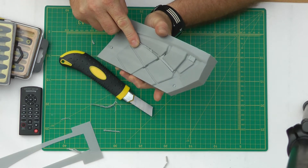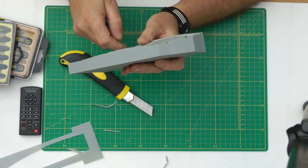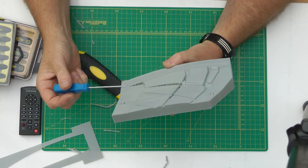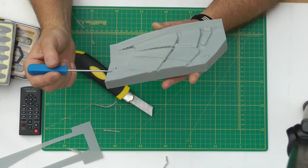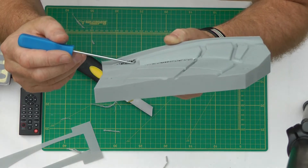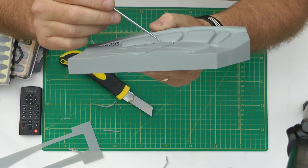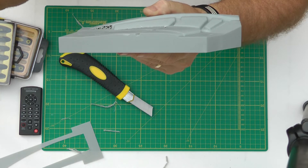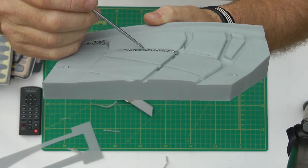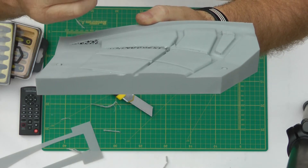This one I didn't slice correctly, but I'm going to still use it. It was the first part where I did a melty sort of infill on the inside, and I asked the software not to put any tops on it because I didn't want a top on the join where the two parts join. On areas like this it doesn't put a top layer — you can see there. I'm going to fill that; it's not a problem. The issue is the infill inside is at 10% with a 0.1mm layer height, and it's very difficult for it to bridge that in just two passes with only two shells.